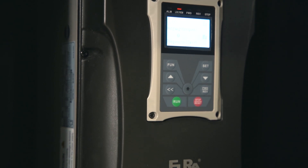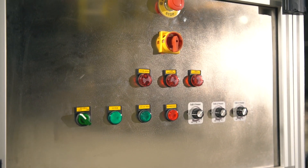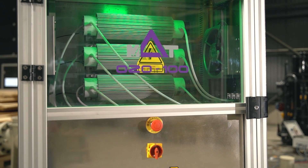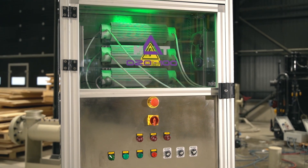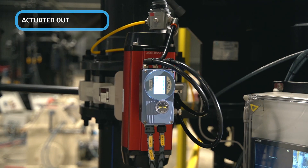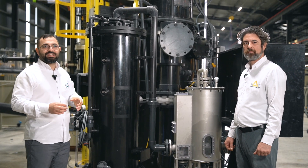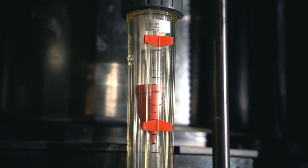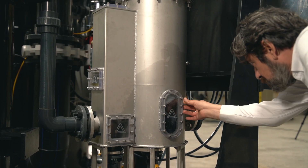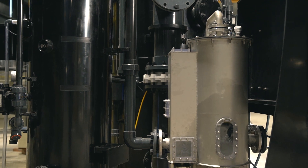However, simply removing total suspended solids is often insufficient. Where turbidity reduction is also necessary, the ozone skimming solution becomes essential, thanks to the power of ozone to polish the water. Our ozone generators are precision engineered to provide stable ozone output and can automatically regulate based on inbuilt ORP and dissolved ozone water sensors on the protein skimmers, ensuring water quality and safety. The foam extractor extracts thick foam from the protein skimmer collector heads, ensuring residual ozone gas and air is safely separated from the wastewater. Thermal catalytic ozone destruct units are a solid solution for rapid and safe ozone destruction, providing superior safety and compact design.